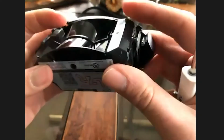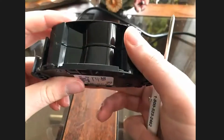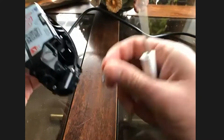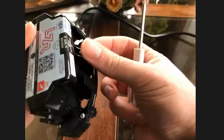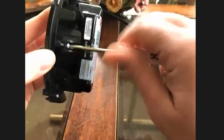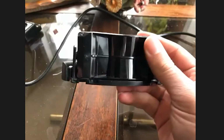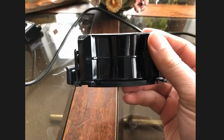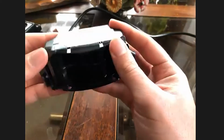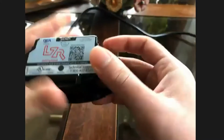And how is this great for troubleshooting? Because if you had a system, a pair of doors, as an example, dual egress doors, and you had a problem but don't know where the problem is, you can turn it into a single door by going to your hub, which we will do later. You could turn it into a single door and do a learn on your right door. On its own, turn it to single door, unplug door B sensor, and just plug into door A. And then you would conduct a teach-in, and if it's successful, then you know you have a good door. Then you plug the other door in, and if the teach-in did not conduct properly, you're like, voila, I know which door is causing the problem.